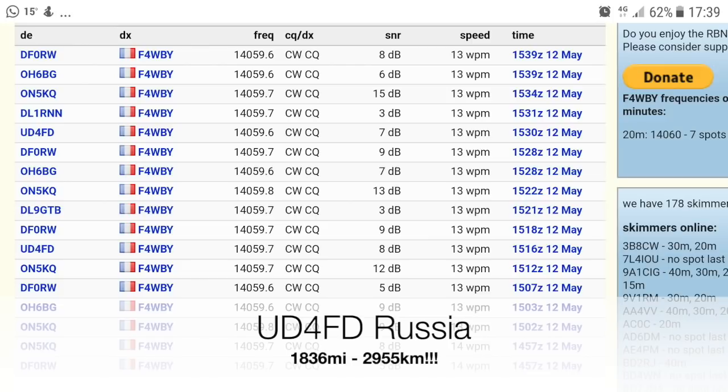I would still carry one when nothing else is possible because it beats nothing any day. If anyone doubts the efficiency of a quarter wave antenna on 20 meters with four radials — proof is it works extremely well, and the QRP Guys tri-bander works extremely well. On 20 meters it doesn't use any of the two toroids or switches on the board, so you could just make one simply using an antenna socket and a little bit of wire. I was expecting the receiver to be more sensitive but I suspect there is something wrong — maybe I messed up something during the build. I should get a lot more volume, a lot more hiss at full volume, and I don't. Dennis, let me know if this is normal or if I should be expecting more volume out of the receiver. I spent a nice afternoon in the park, it was sunny, surrounded by trees, and I had a good time. That beats television any day.